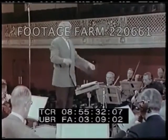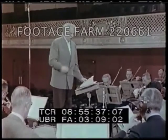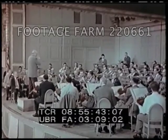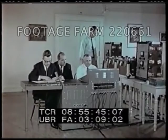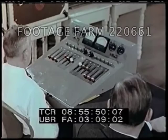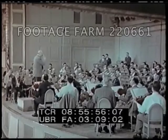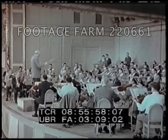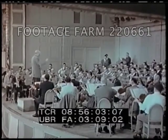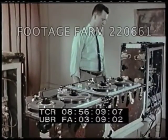The third important requirement in a high fidelity recording is frequency range — capturing high notes as well as low. This is actually accomplished before the session begins. All it takes is recording equipment of enormous cost and capacity, such as this recording console. It faithfully handles all sounds audible to the human ear — the entire frequency spectrum from 20 to 20,000 cycles per second — and with less than two tenths of one percent distortion, it transfers them to the swiftly spinning magnetic tape.